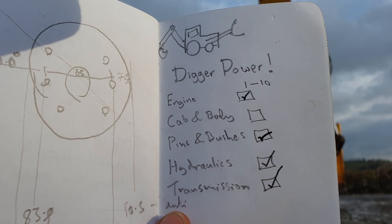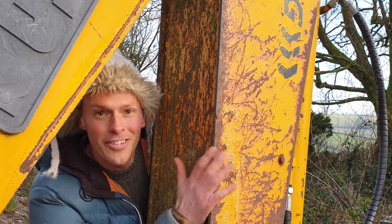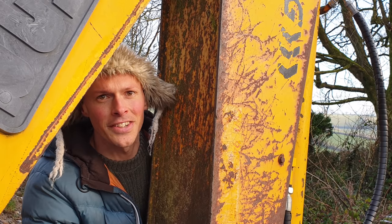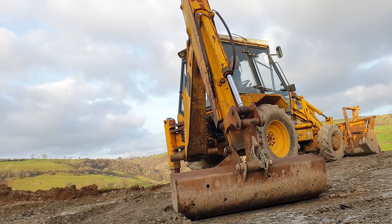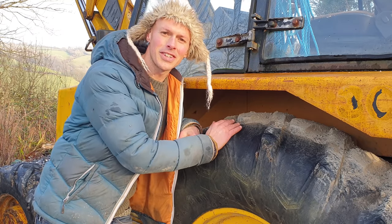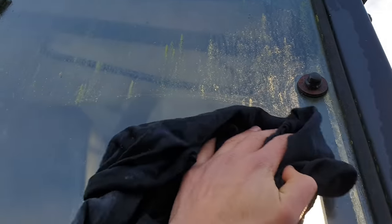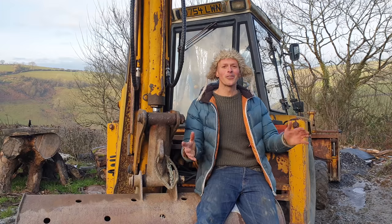Let's look at the fifth category: the cab and the body. This is basically everything else — rust and bent out of shape bits. Have a good look and see what you think. Is the rust just surface or does it go deeper? With things like the back actor, it's very common for the paint to get scratched off, but the actual material is so beefy it's just fine. If you've never checked on the price of tyres this big, you might be surprised — they're quite expensive. It's definitely worth factoring in the wear level of the tyres, or for that matter tracks on a mini digger too. Is all the glass intact and how much moss is on there? Do you need to replace the seat straight away? How many buckets come with it, what are they, and how much dentistry do they need?